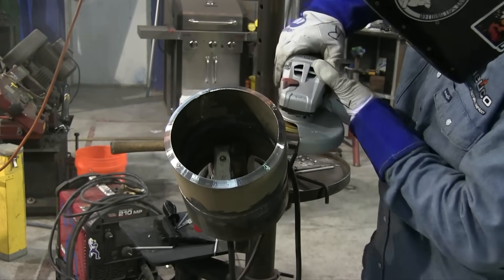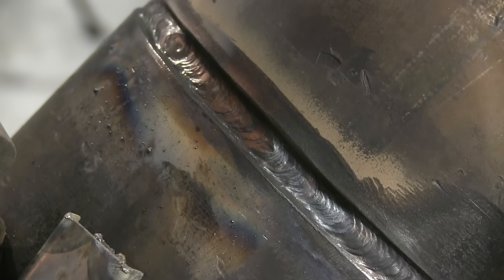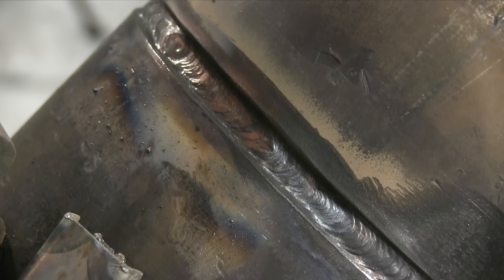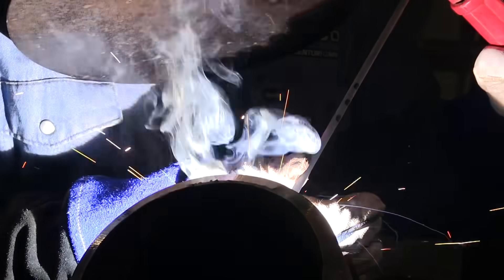So that hot pass is done. A little wire wheeling and it'll be ready for the cover pass, but not quite. We went with a 1/8-inch 7018 all the way out because occasionally that's required, but probably would have gone a little better with a 3/32 hot pass followed by a 1/8-inch fill — would have been easier to stay slightly below flush before the cover pass. There's a little low place, so we're going to fill that in before putting the cover pass on. Sometimes it's better to just run a couple of small fill passes in that area rather than fight carrying extra metal on the bead. Once the cover pass is done, you won't even be able to see them.